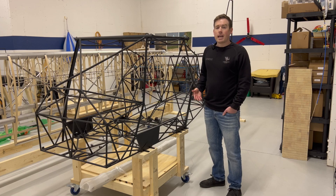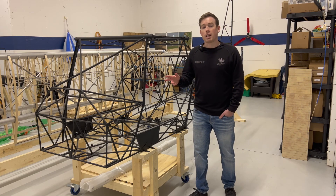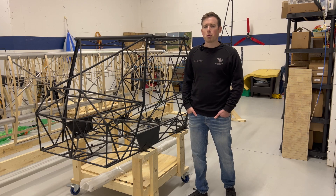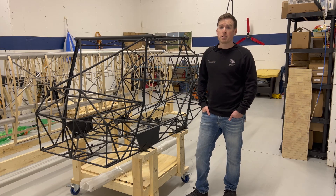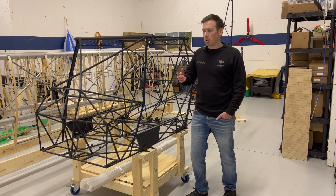With building your own aircraft you have nearly endless customization options so that the end product is an aircraft that's perfect for you. In terms of the choices I've made for my build, working front to back, I'm going to go with the Rotax 912 IS engine paired with a 70-inch three-blade Airmaster constant speed prop. This seems to be the ideal engine and prop combination for the Super Sport based on what I've read and the conversations I've had with other builders and owners. The engine is really fuel efficient and its preferred fuel is unleaded automotive fuel, although it can also take 100 low-lead avgas, which is what's most commonly available at my local airports.